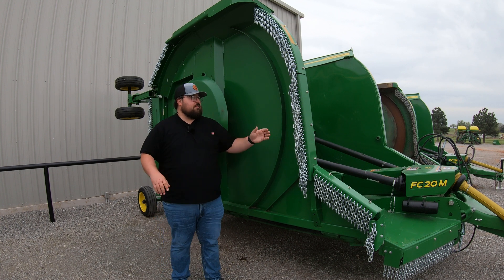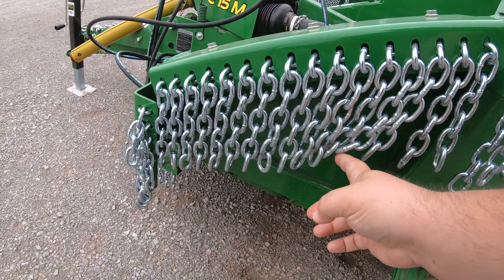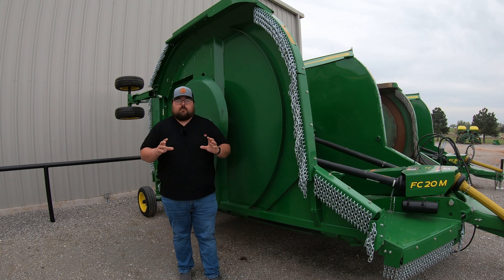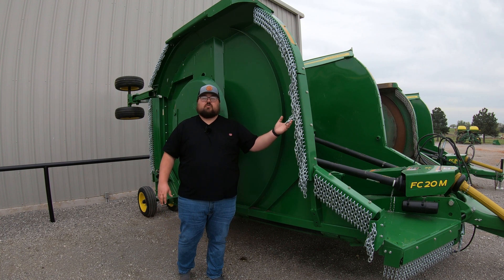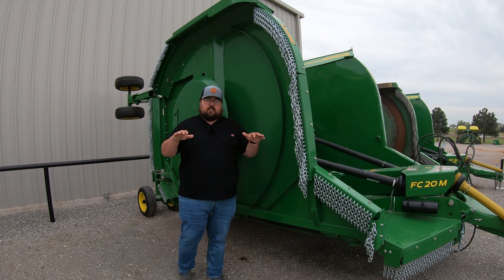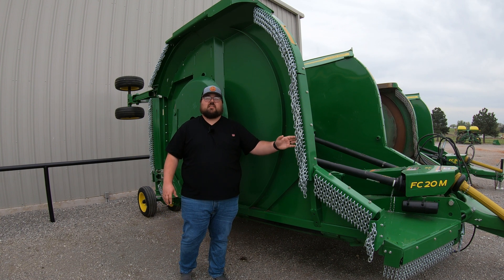One of the safety features we need to mention is the safety chains on these machines. You're going to see these on all of these cutters, front and rear. This is just to make sure that whenever you're out mowing, you are not throwing debris so that you're not limited to where you can cut. You should be safe with most all debris with these chain guards on the front and rear. You do want to be careful when next to roadways — you may want to shut that machine down on a busy roadway so you don't throw material out. It's important over the years to make sure that if these are getting worn out and you're starting to lose links, you change these out. It may seem like a costly repair, but when it comes to safety while using these cutters, this is a big deal.